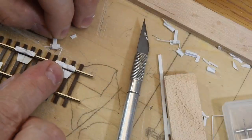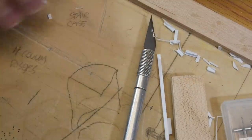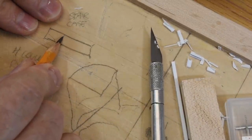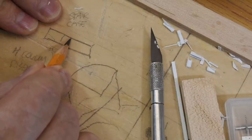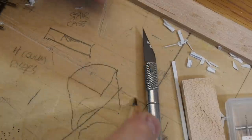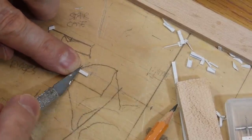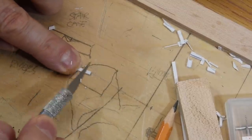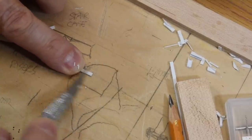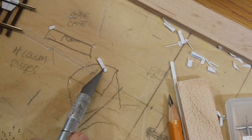Okay, now you can do that by popping it off the rail and then gluing it back on, but use a very sharp knife. And here's a little tip for you when you want to cut into solid stock. Say this is the dowel and you want to cut a notch into it. You can press down and risk going all the way through, or you just put a bit of a cut and then go in on an angle and just sort of chisel it out. You'll go like this, press down, and then go in on an angle and take a wedge out, and then you just take little cuts like that, and then square up the end until you get the little notch that you want, okay?